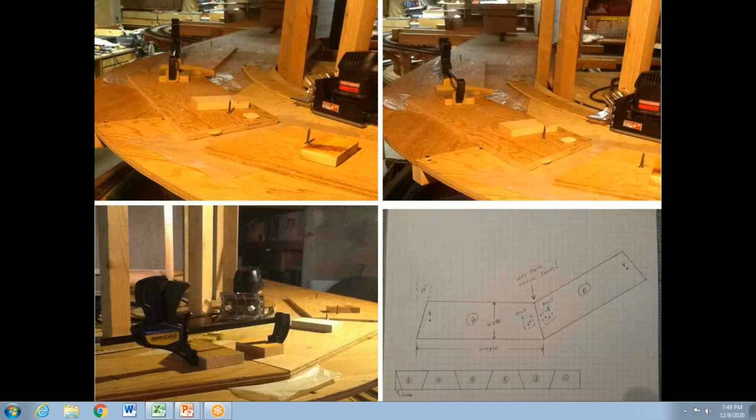So what I've done is developed a biscuiting method, where you take a sheet of plywood and basically make corners out of straight pieces. If you look at the photo on the bottom right, the bottom strip of plywood, you figure out your width, how wide you need them, and how long you're going to need the pieces. You rip your plywood, and you cut your angle. I used a 15-degree angle. You can use whatever angle you want depending on your scale or application.